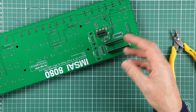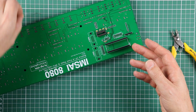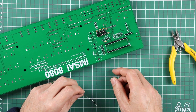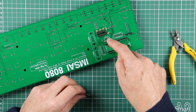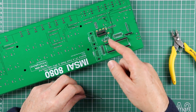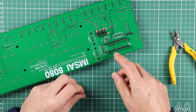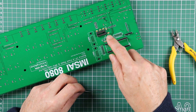The chances of you needing to do that are pretty slim, and to be honest it's just as easy to pop the ESP32 out if you did need to re-flash it over USB. In addition to that, I've also provided the facility through the desktop UI to re-flash the ESP32 using a drag-and-drop interface and doing an over-the-air, over Wi-Fi flash. So these components are almost redundant, and in fact on their own they're not enough to make the solution work — you do have to put two extra bodge wires or fly leads that solder directly onto a couple of components on the ESP32.